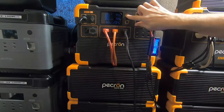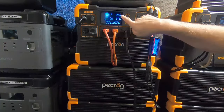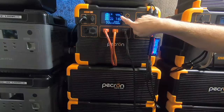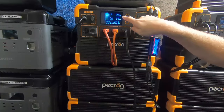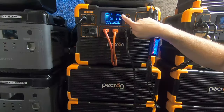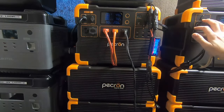I live and die for those panels — they're good panels, especially for the money. A hundred bucks and you get a hundred watts. It's only about 9:30 or 9:45 in the morning and I'm already producing about 440 watts off that 600-watt array, which is outstanding. Usually when you buy panels you get like 60 to 80 percent of the rated output, so getting anywhere close to rated output is absolutely awesome.